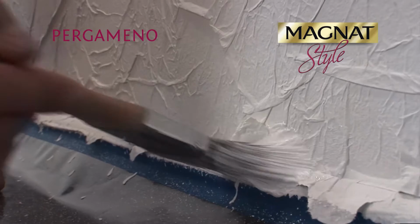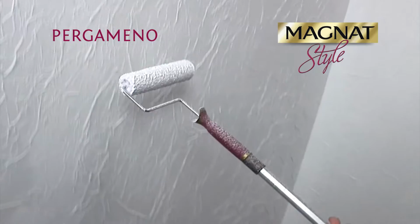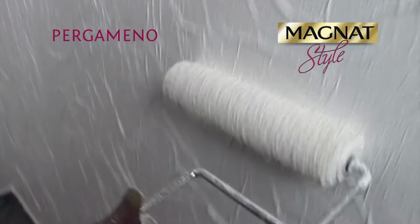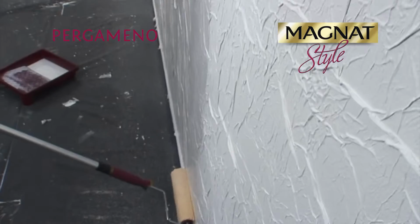Once the texture has dried, reinforce it by coating with a layer of MAGNAT Style distemper. Use a brush. Apply the distemper carefully to thoroughly cover all paper creases. Leave the coat for about 6 hours to dry. When working on larger surfaces, coat the whole texture with the colorless rustic top coat sealer. This will reduce drying of the successive coat and facilitate the coloring of the surface.